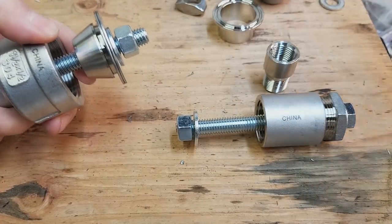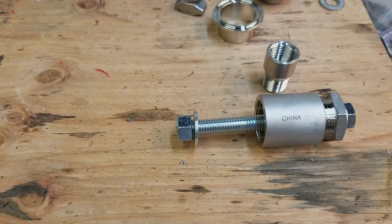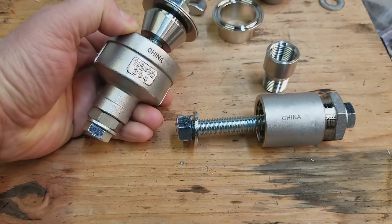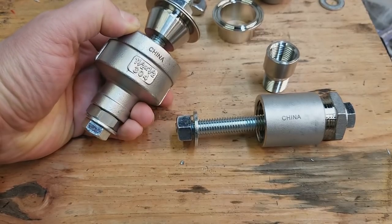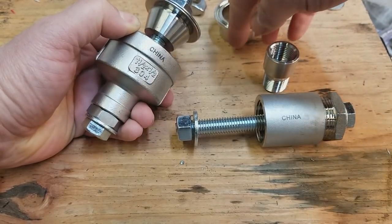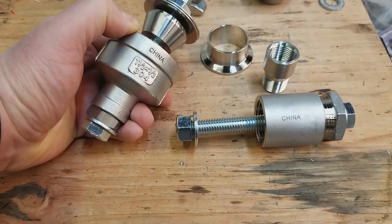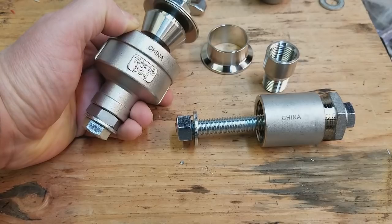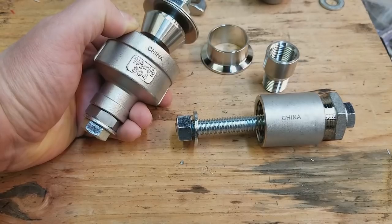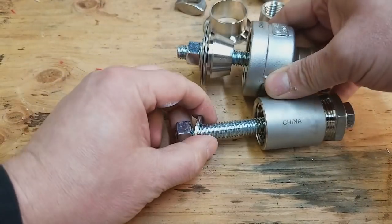This new tool allows you to solder the ferrule in and has a lot of advantages over other methods. The old solder-in flange we sold was a specifically machined piece that made it easier to solder onto the surface of a pot, but this allows you to use an off-the-shelf weld ferrule — basically four or five dollars — and get a similarly robust and pretty sanitary job as well.